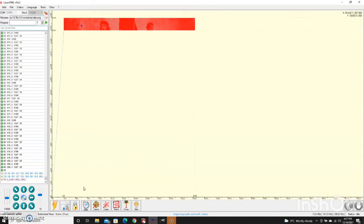Laser GRBL is a lot different than LightBurn in that it generates all the G-code before you can get started, so LightBurn goes pretty fast but Laser GRBL does take a little bit to create the file. What I do like about Laser GRBL is down at the bottom it shows how long it's going to take — an estimated time for it to burn that image. As you play around you might find it starts off at say six minutes but once it gets going that might extend up to seven or eight minutes depending on if it's buffering or slowing it down. So all you have to do is come up here and click Connect to your laser.